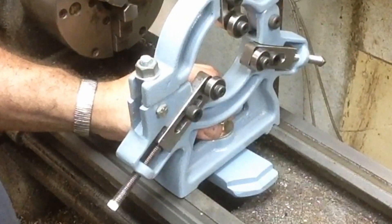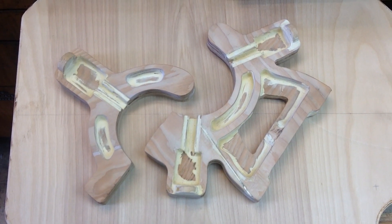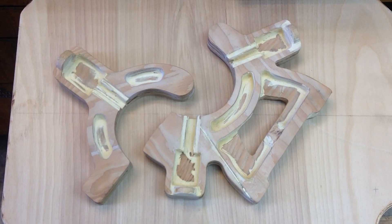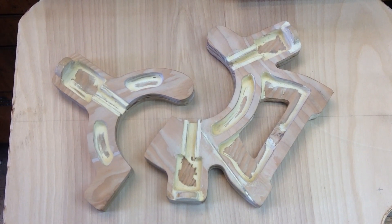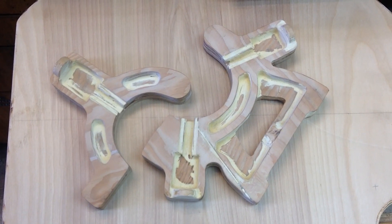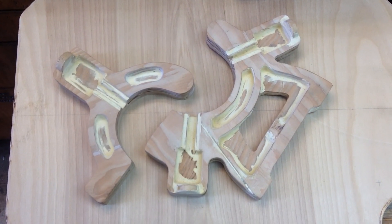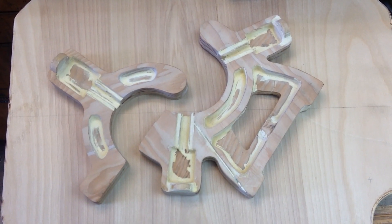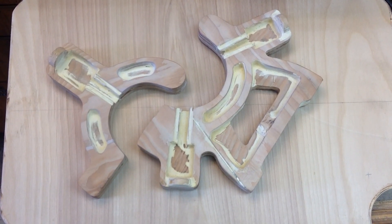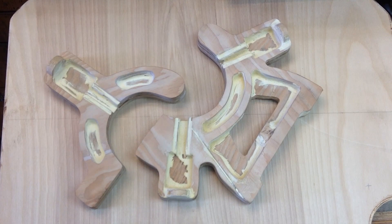Here's a little teaser for those who've seen some of my foundry stuff. This is the beginnings of the setup for the match plates for the steady rest we're just finishing our restoration on. At some point this will be a reproduction - we've got the patterns pretty well developed, still got to do the final sanding and get finish on them and get them mounted to a match plate. They're going to be a pretty good reproduction once we start casting cast iron. Hopefully you found this interesting. If you'd like to share these videos I'd appreciate it, and if you haven't already, please hit the subscribe button. We've always got some new and different project going on - leave any comments or suggestions below, and thanks for taking the time to watch.